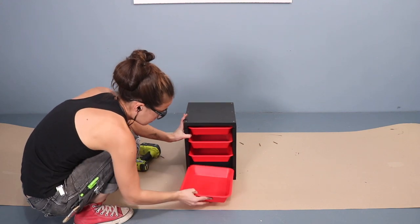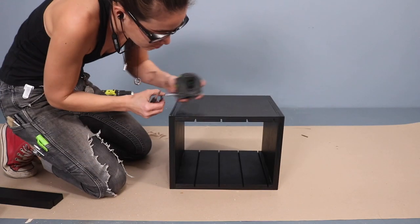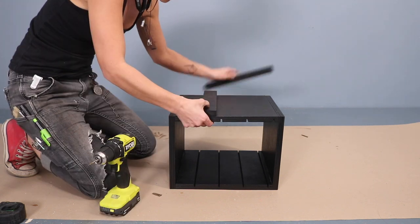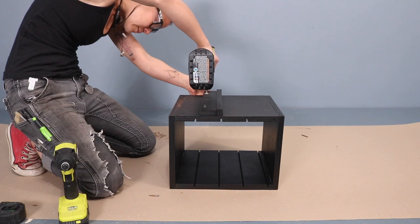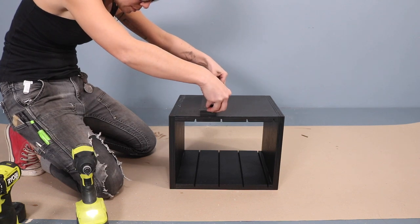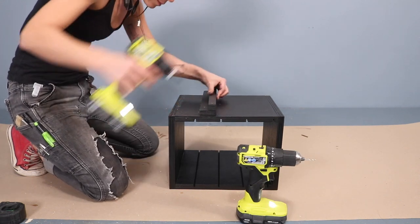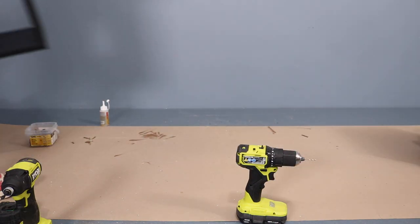The drawers stick a little bit, but with a little bit of paste wax it'll be fine. That right there is actually a complete project, but I decided to take it one step further and put a shelf that spans the distance between the two boxes. I did this by turning the box on its side, measuring where I wanted the shelf to be, and then adding a support piece of plywood under that, and an even smaller support piece to that. This little piece is important because when I drill through the top of the shelf to attach it to the supports, I'm going to be drilling straight into that little tiny piece. And I did the same thing on the other side.